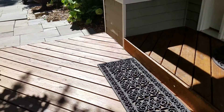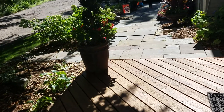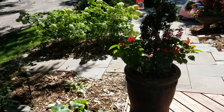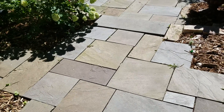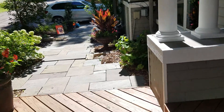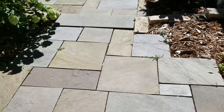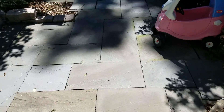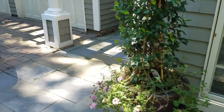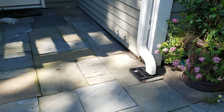The second part of this is the bluestone — they've got a bluestone walkway and patio that needs to be reset. Currently there is class 5 and sand underneath it; we're going to bid to replace that with three-quarter-inch clear and also to reset their slab steps. The first area including the walkway is 82 square feet, the second area is 100 square feet, then 133 square feet to the driveway.